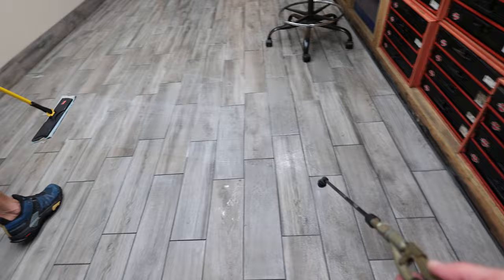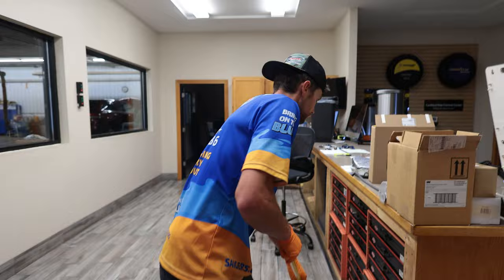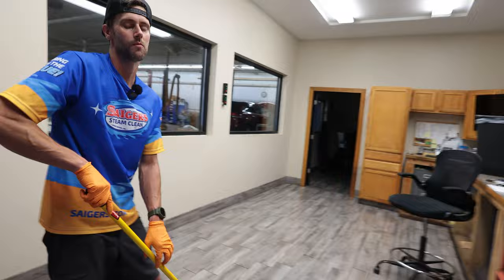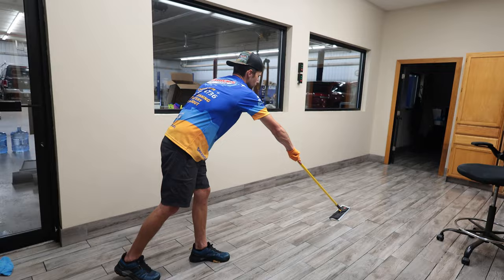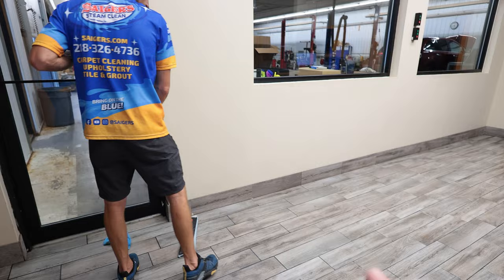You remember how many square feet of tile and grout? Well, even the carpet. How many total square feet was there? About 2,000 square feet. So in 2,000 square feet, maybe a gallon? You didn't have a full gallon in before, did you? Probably took about a gallon for all of it. A gallon for all this in 2,000 square feet, including the carpet. That's darn good. We say about 1,200 square feet, but because some stones and travertines will absorb more, you kind of got to cushion it.